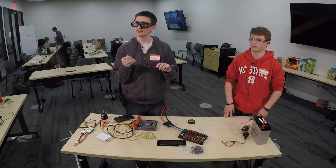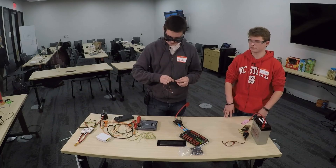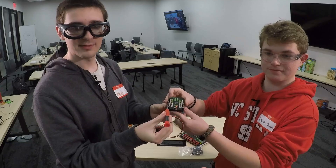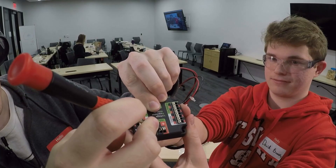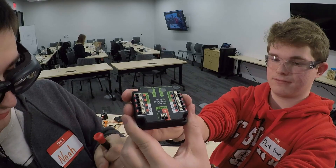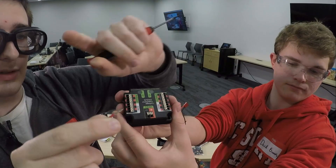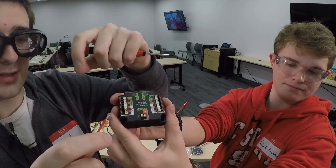It can be a fairly thin gauge — this is 14-gauge wire. Don't want it to be too thin. These connectors work by pressing in on this piece here, which opens a tiny little door inside for the cable to get pinched in. You take your wire and generally you want to wrap it to ensure that all of the threads are together and none of them are spewing out at weird angles. If you have a soldering iron you can also add a little bit of solder to ensure that all of the strands stay together.